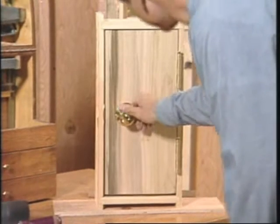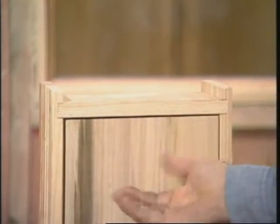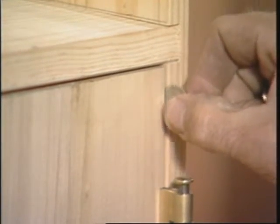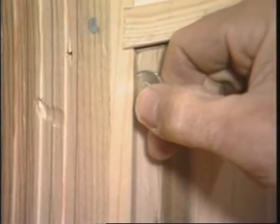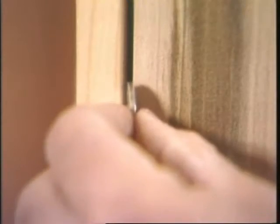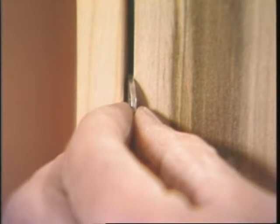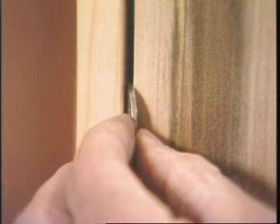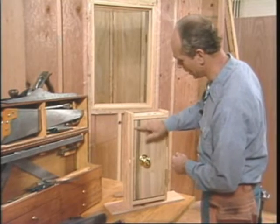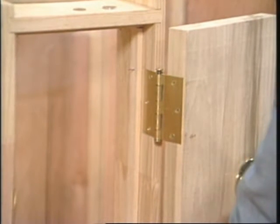That looks good, and the margins look good. The margins should be equal all the way around. In the old days, they used to call it nickel and dime — they used a dime for a thickness gauge on the hinge side and a nickel on the latch side, and a nickel across the top. This door is a little bit greater than that because it's winter and the door is contracted. In the summertime it'll be tight, so if you fit your doors in the winter, make it a loose nickel. In the summer, make it tight. Sometimes margins can be closed by paint buildup, and if you have to reduce the size of the door, take it off the hinge side and then reset the hinges.